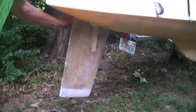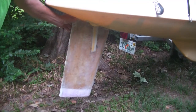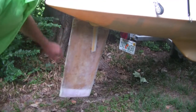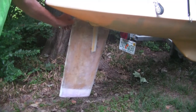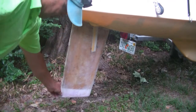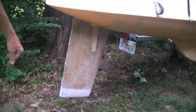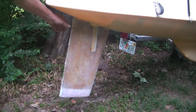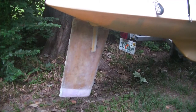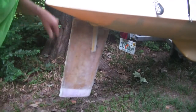When you're glassing this, you're not going to be able to get it really smooth with just the fiberglass mat. I use colloidal silica thickener in my epoxy, and that helped me get all the edges smooth. There's a lot of sanding to do — when you first start you see some ridges. Sometimes it's easier to mix up another batch, put that colloidal silica in there, and run it over to get rid of the ridges, and then you'll get a nice smooth surface.